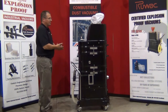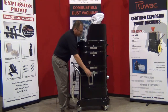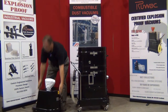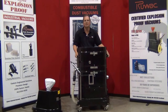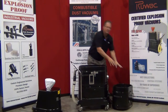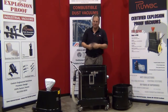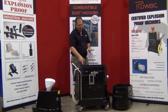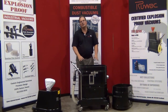Maintaining this machine is very simple. There are four clamps — two on each side — to remove the motor deck, giving full access to the filters. These are fully cleanable hydrophobic filters at 40 square feet, along with the demisting pad. Removing that chamber gives access to the demisting pad and filtration, which can be serviced at any time. Looking down into the chamber where all the mixing and quenching happens, you can monitor and clean it as needed, rinsing it out through the discharge hose. An internal cone directs all material downward.